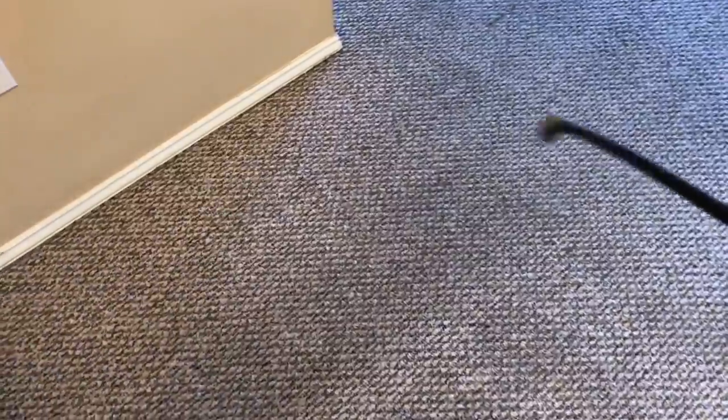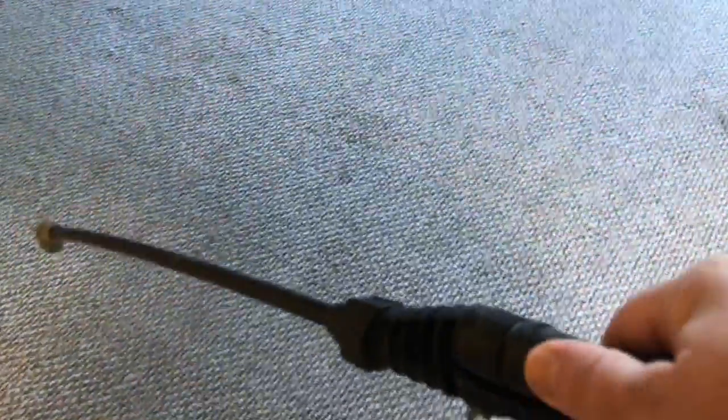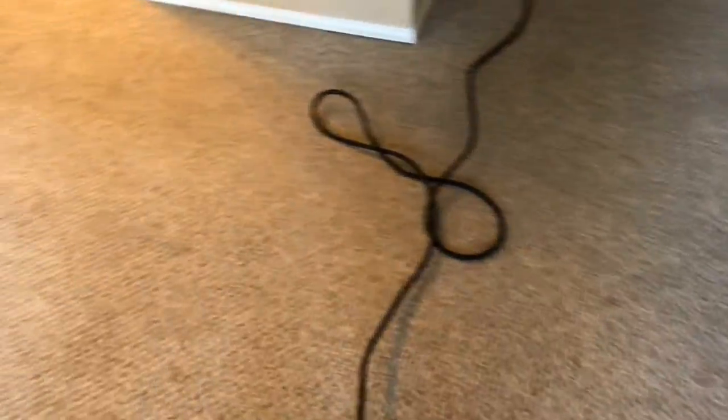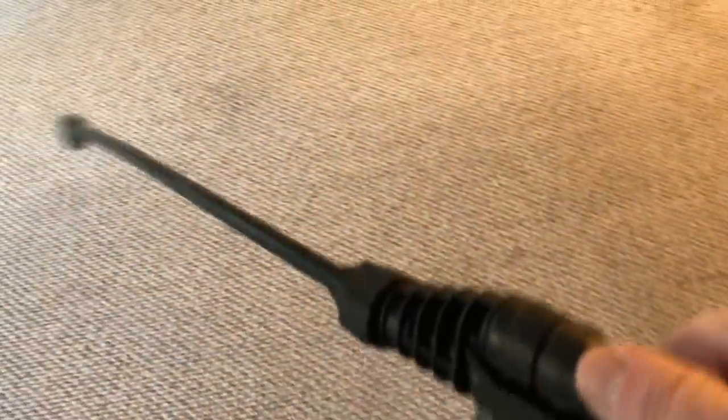And if you're trying to learn carpet cleaning, the water or the solution is the vehicle that transfers the soil into the pads. So you absolutely have to have enough pre-spray on there to what they call suspend the soil. And the Green Dragon will actually go in there, and I think it's a mild form of encapsulation or soil suspension. It will pull everything out of the fiber and leave it in suspension so that when I come through with the Zinger pad and the scrubbing strips, I'll be able to draw it up with the heat and the friction and the material in the pad.